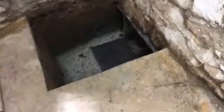And then specifically the ones inside here, we're going to pour back this section of the floor that we saw cut out. And then as far as the basement stuff, once that's done, we'll get everything cleaned up on the floor, get all the visible, accessible cracks sealed with polyurethane. As you can see, we've already got about half of the basement walls remortared, so we're going to finish that up.